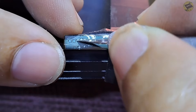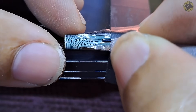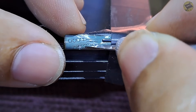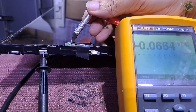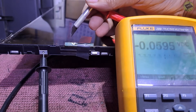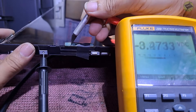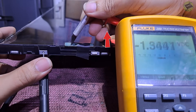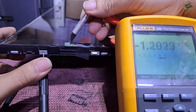I don't remember the data of this COF, so when I encounter this kind of issue I will troubleshoot again. Let's measure the test point voltages. The tip of my test probe is not sharp, so I use the blade cutter to tap the test point so we can accurately measure the voltages.